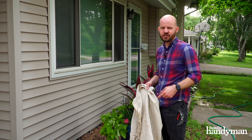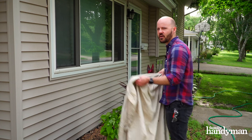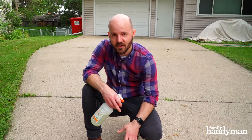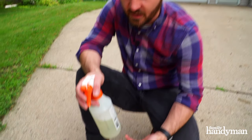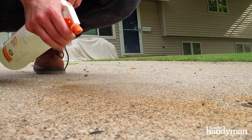To protect your plants, shrubs, or garden from detergent or the power washer itself, you're going to want to place a tarp over the plants. I highly recommend spot treating rust stains, oil stains, and paint stains — anything that's difficult to get out — with a concrete detergent diluted to a 1 to 20 ratio before you start power washing.